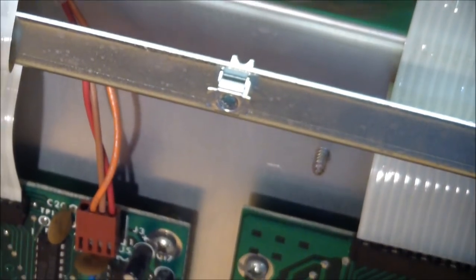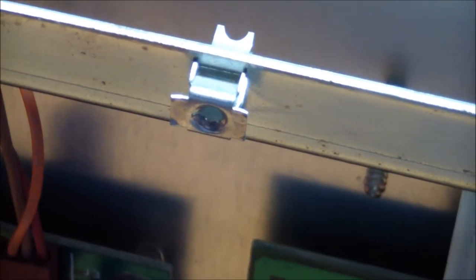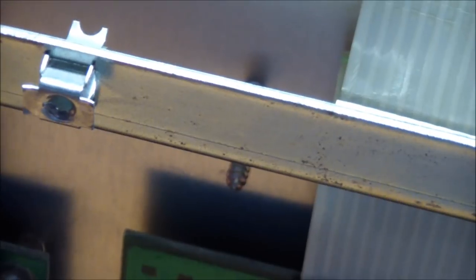towards the board. And what happened here, I guess this was the offending one on the bottom, was when those screws were tightened really well, then the flaps on the mounts, these flaps, basically, since they were pointing towards the board, pierced the board. And in most cases, that didn't make a difference. But on the middle lower screw, it actually pierced through a trace. And since this frame is grounded, it just grounded the trace. And voila, nothing worked.